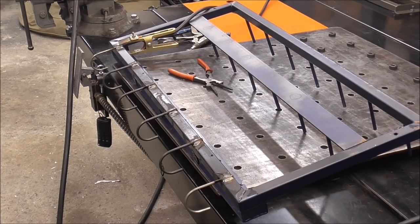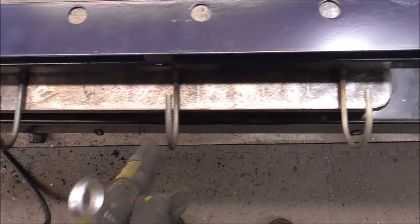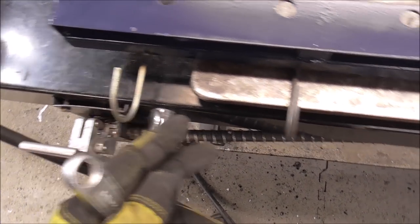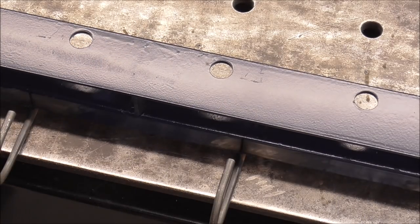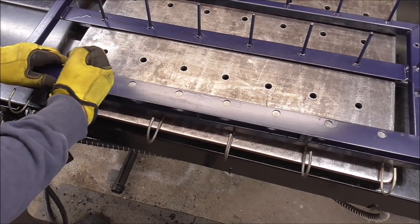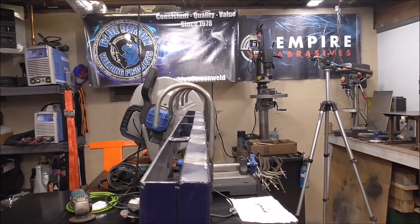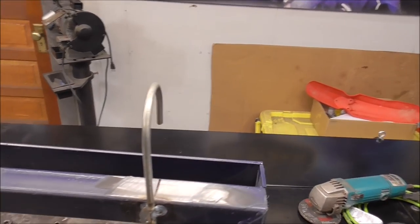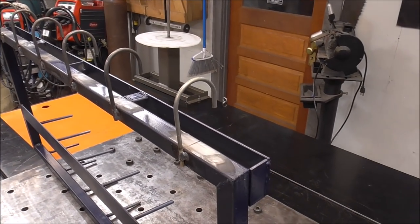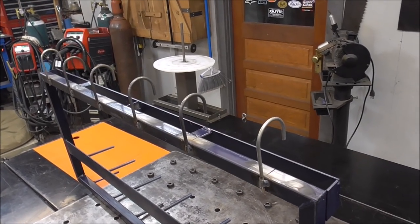That's it — now I just have to turn them over and straighten them out, make them look good in case any are tweaked. A couple of them I've got to tweak — this one's way off, I've got to move it about 90 degrees. They're real good but some of the hooks just need to be bent just a little bit before we paint them. There we go — I think we're all set. And I should have done that to begin with, but like I said I build a lot of this stuff in my head. For the most part it's eighth-inch diameter round rod, so if you're building one of these, make sure you put some of these hooks on. I've already wiped it down with mineral spirits and now I'm going to paint it.